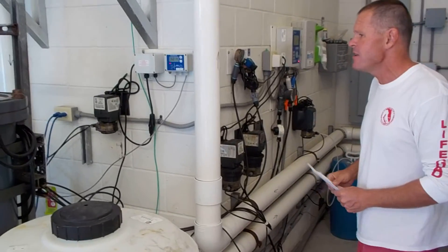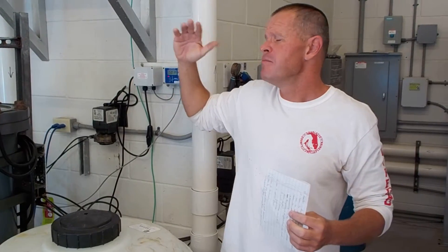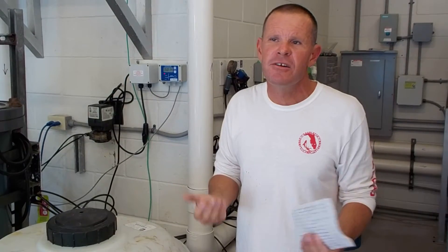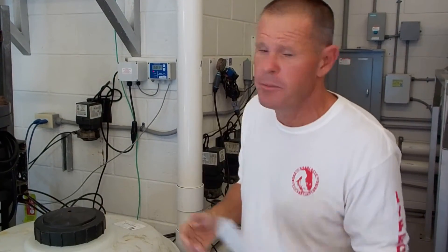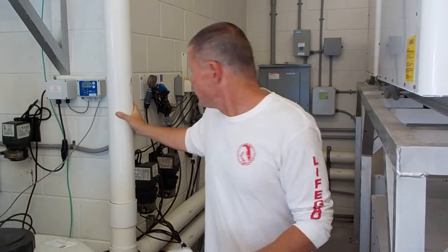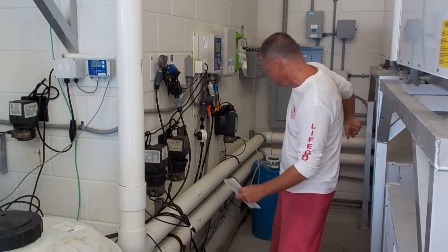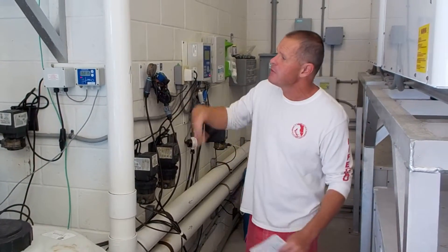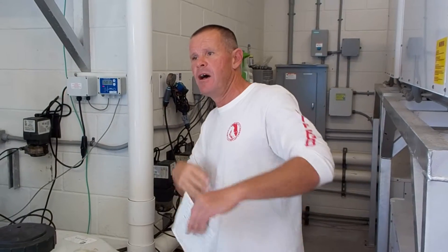Best is to just come here and look at it. What's heater bypass? Basically, the majority of the water doesn't go through the heater or chiller assembly — only about a third goes there. I'm going to make a separate video about the heater procedure and how to operate it. This bypass valve we never touch — it stays partially open just to allow enough water to bypass and enough to go to the heaters. Those two pipes channel the portion of water to the heater assembly: the bottom one goes through the heaters, this one comes back from the heaters. You can feel it when they're running — the top pipe will be warmer than the bottom one, a good indicator that the water is actually warmer. This will be reversed if we're running in chiller mode.